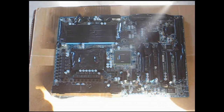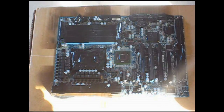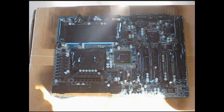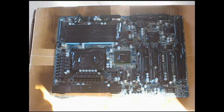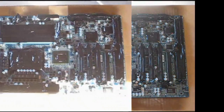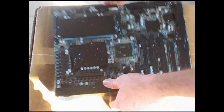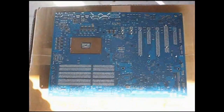I prefer not to cover up the power circuits — I'll actually clean those off with a cotton bud after I've finished spraying, as I prefer to get a nice even coating in between them to make sure that little legs won't get a short. Very easy. Now that we've done the front side of the motherboard, we'll simply turn that motherboard over and repeat the same process on the back.